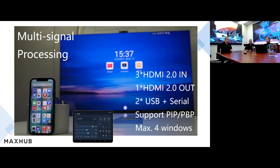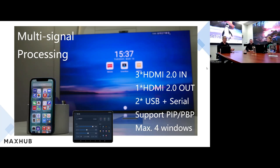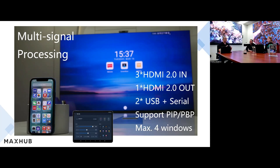Someone asked, can we install an HDMI receiver behind it? Because it's only one point, that's a very good question. So can we install devices behind it? Because we're 1.2 inches deep off the wall, there's not a lot of space. However, in the past, on some past installs, customers wanted to do that. We recommend a recessed outlet, 3.5 inch recessed outlet, so we can hide all the electrical wires. And if you're doing recessed boxes or panels, you would cut a hole in the wall, and then you can fit any kind of HDMI device that you want into it and usually plug it into a network. So yes, you can do it. It requires a little bit of planning when we install it. That's all.